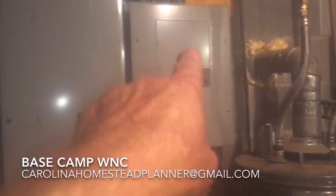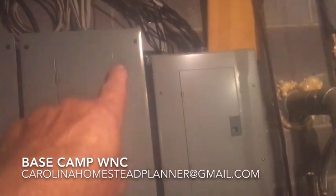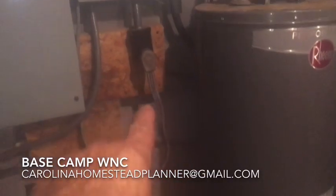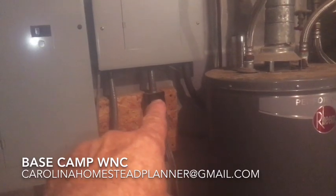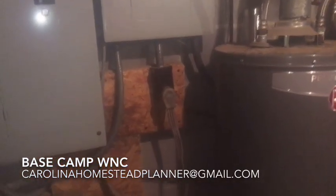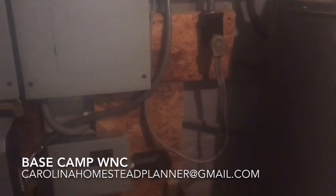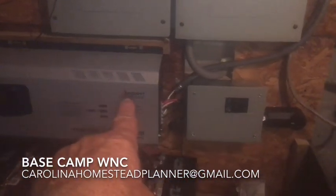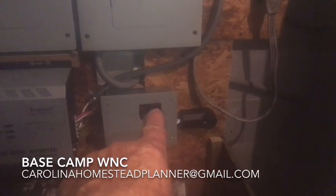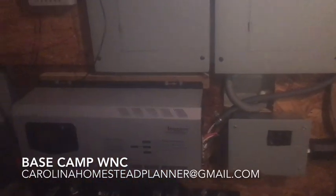What this is — this covers all the lights in the kitchen, the furnace, and stuff like that. The pump line comes in here, and this cord right here that we have plugged into this one runs AC power from the grid or through the generator. So we plug the well into that. When this system's up and running, here's the inverter — it comes out through a breaker panel. We've got a 220 breaker and another 15-amp one, but then that plug will go into here, and at that point it runs off this box and everything is solar.